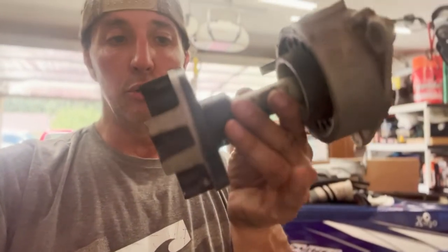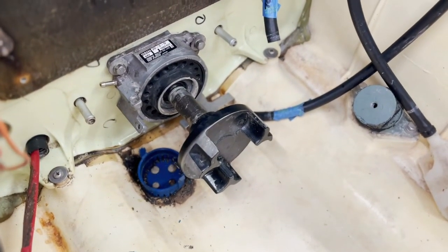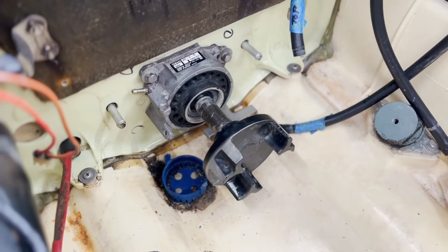Here's a quick picture just in case anyone from OSHA is watching. The correct way to do it is not the way I did it — the correct way is to remove the coupler from the shaft, put it in your press, support it underneath, and then press the shaft down to wherever it needs to be. I got the same results doing it my own innovative way.